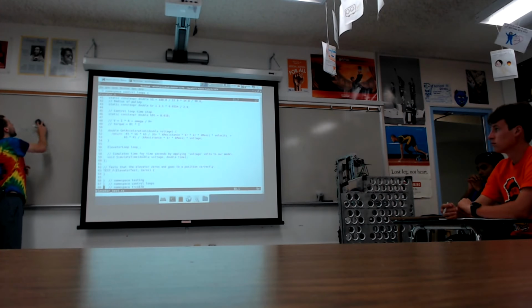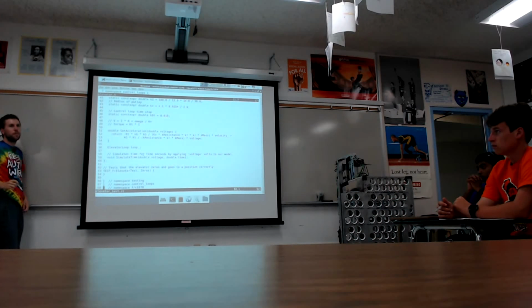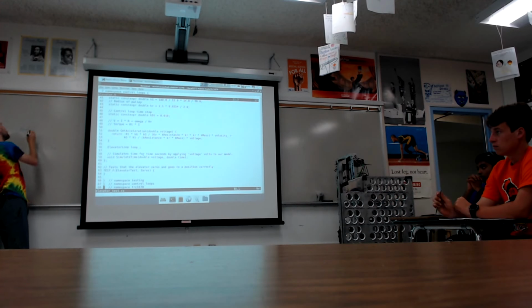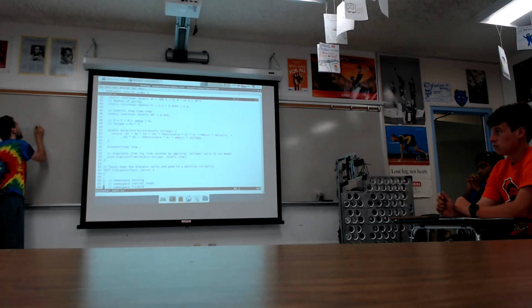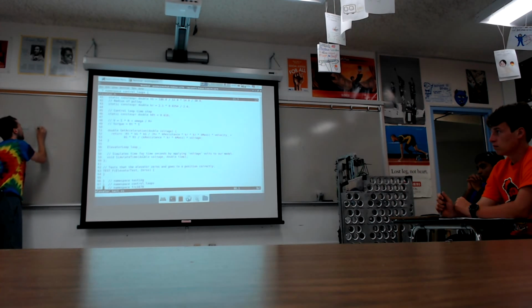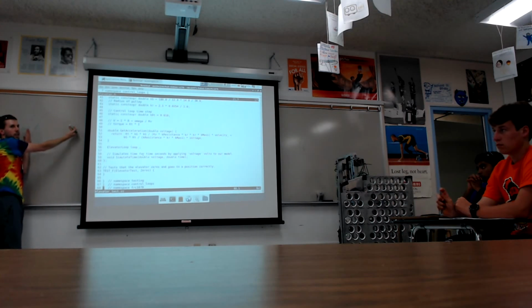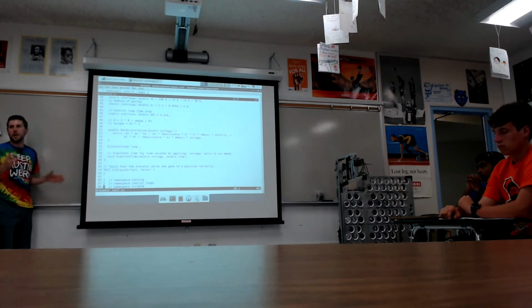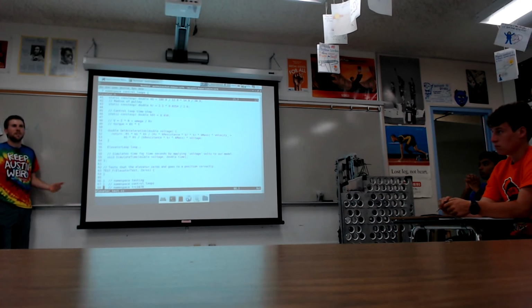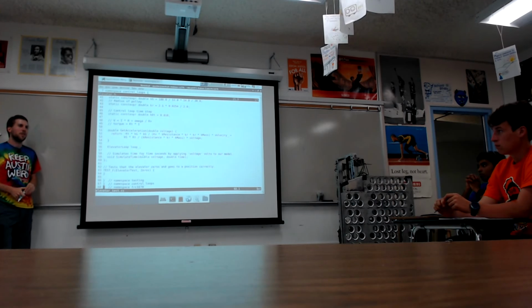So what if our acceleration is instead some function? What we can do is draw a bunch of little boxes, just split it up into a bunch of little chunks. Over the interval, the integral will be the area under this curve. As you can see, the error is these little triangles. If we make our boxes really small, the error will be small enough that we can ignore it. So that's going to be our way to get from acceleration to velocity.